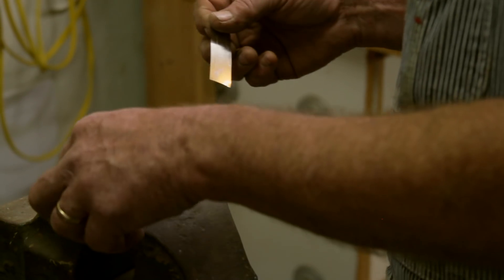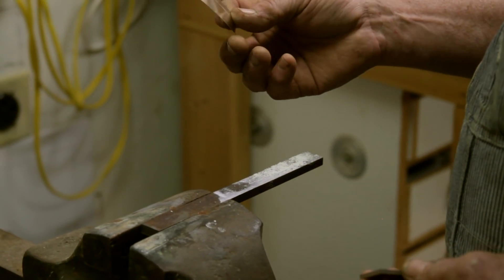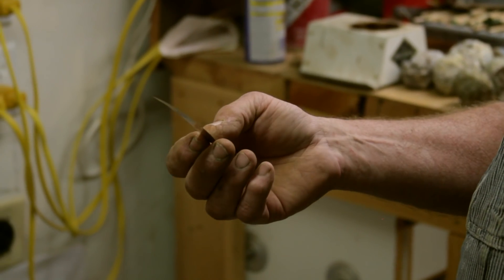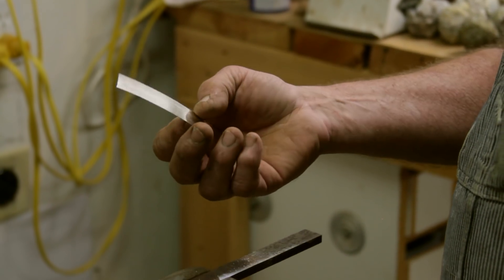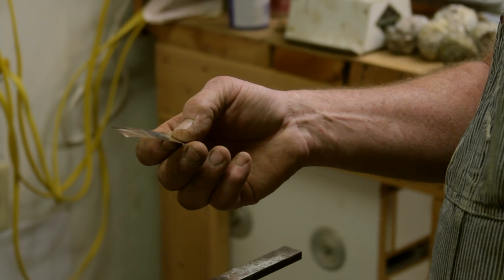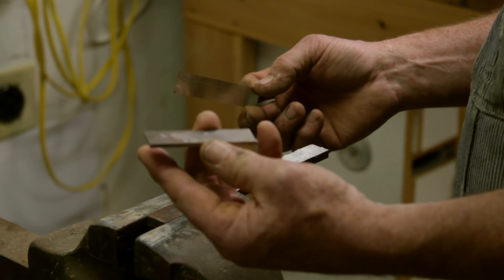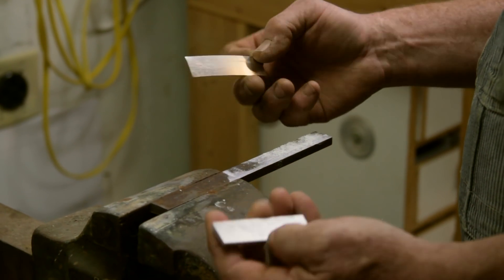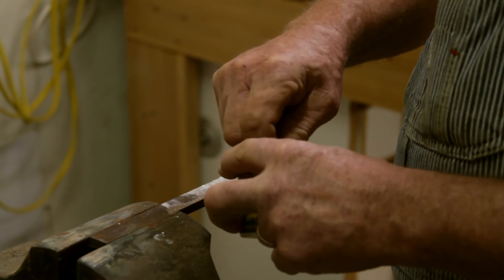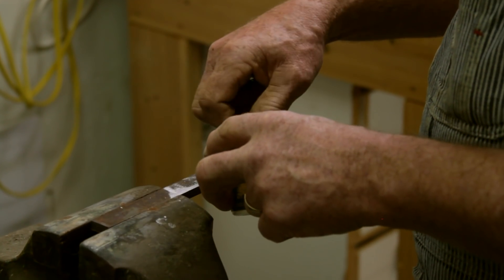We're going to be putting together three dissimilar metals. We're going to be putting in soft cold rolled steel, silver solder — this is silver solder tape that you can purchase at most any of your local welding shops, this may be a special order, it comes in about a three-foot roll — and we're going to be putting in this tantung piece. Everything needs to be good and clean, and you must use some kind of flux. This is just some old silver solder flux that my grandfather had, so we're just going to make sure that we have flux on here.